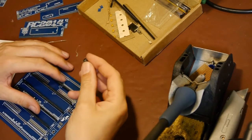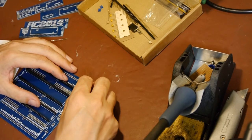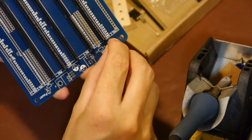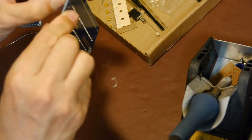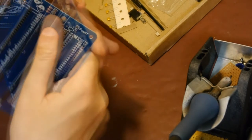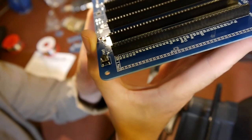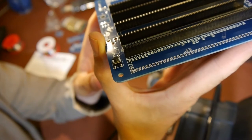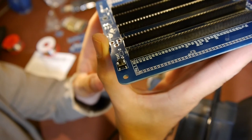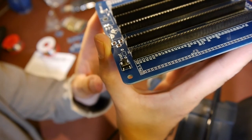I think I'll put the reset button on - you can't beat a nice reset push button. This doesn't go in very easily. In fact it looks like it's the wrong pitch. I've just installed this reset push button here - the legs are splayed out to the side. The spacing used on the PCB doesn't quite fit this switch - another little boob with the layout.